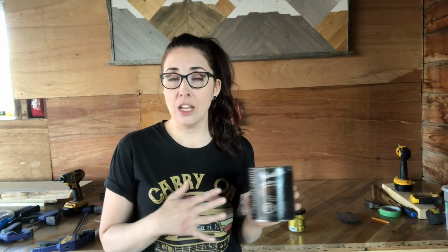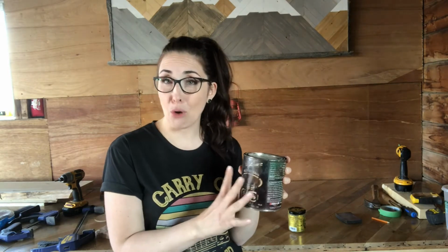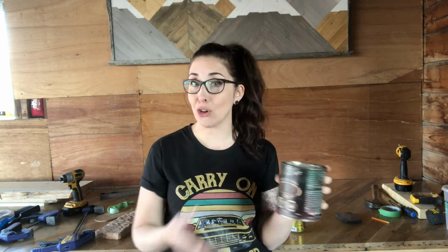You could also, if you don't like the color of your wood or you want to do something a little bit more dramatic, use a stain. So this is going to change the color of your wood for your crib. There are millions of different colors that you can check out. This one here is a dark walnut. This one is my absolute favorite of all of the stain colors. When you're using this, remember to read the directions and clean up properly. Don't leave any stain rags in your garage or around. Those need to go out to the garbage right away, as well as please use gloves and glasses when using it. Actually, I should say for all of these, please make sure you're wearing gloves and glasses.